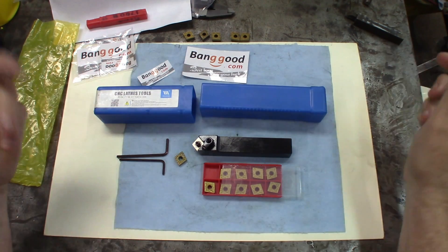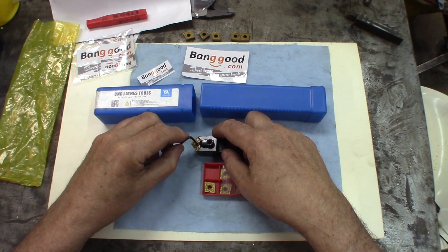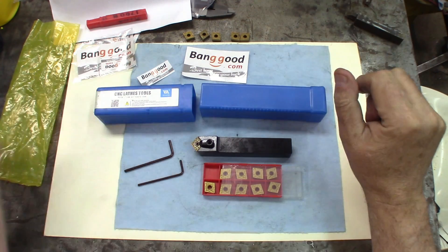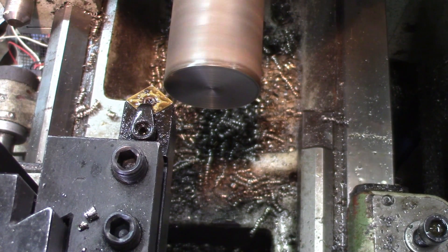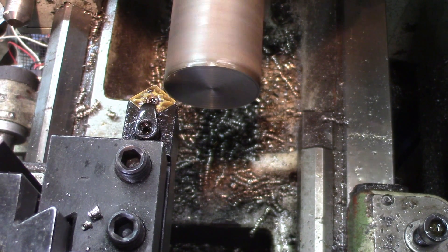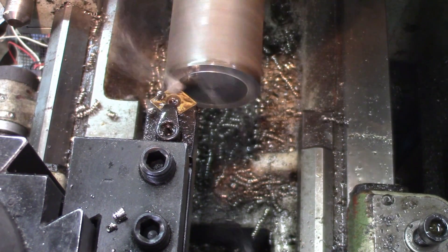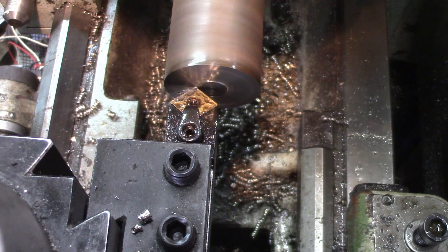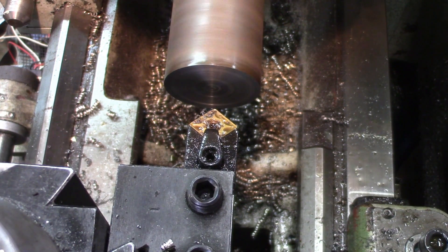It gets right to your door the way you see it. When you install inserts and tools like that, you never wrench as hard as you can — it's not worth it and it's going to cause problems. Nice and snug and that's it. Let's go to the lathe and try this. To start with, let's make a facing cut. I'll be taking about 12 thousandths — that's about 0.3 millimeters. Let's take a cut using the automatic advance. It seems to be doing a pretty good job and it's going to be well centered. This is the facing cut and it goes very nicely.